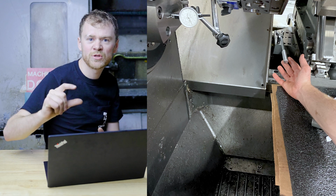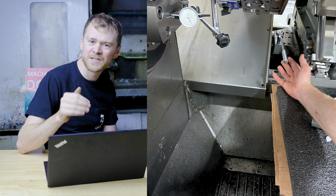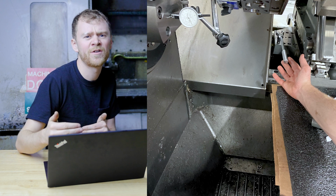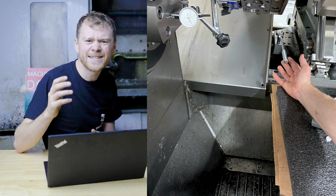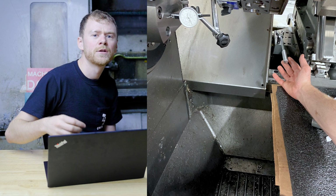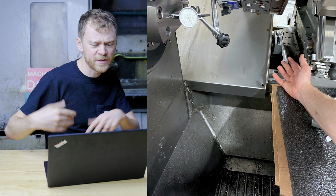So if you notice, the wedge tool that's on the spindle is sitting flat. So I'm gonna dial in Y. The spec for Y is like 2/10 over 4 inches. And you only have about 4 inches of travel if you have parameter, I think it's that 700. It's the one that turns off the wedge angle and lets you just jog Y by itself. Just don't leave any wrenches down there and drive into something. Keep all your tools out of the machine.